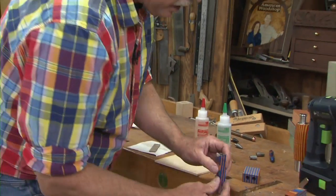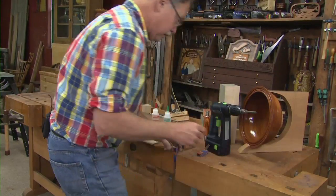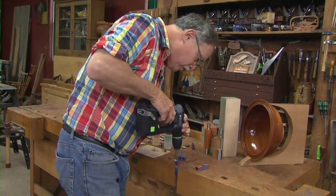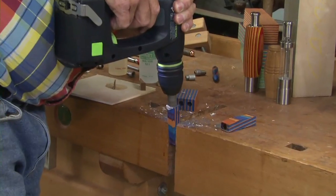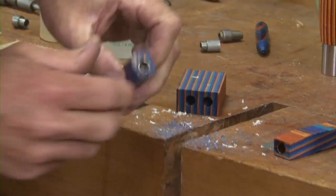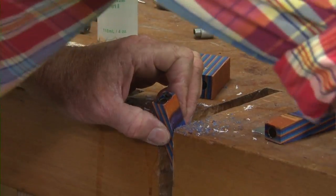This one right here is ready to mill. I'll bring up what's called an end mill — this creates a square shoulder for the mandrel on the wood lathe to seat to. That gives me a nice clean shoulder and a brass ring all the way around. I'll do the other end and then it's on to turning.